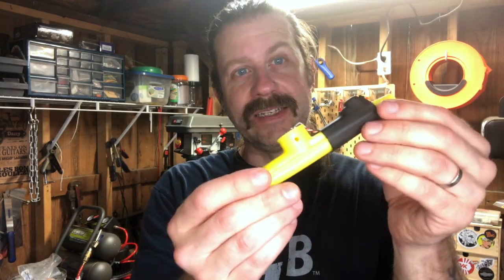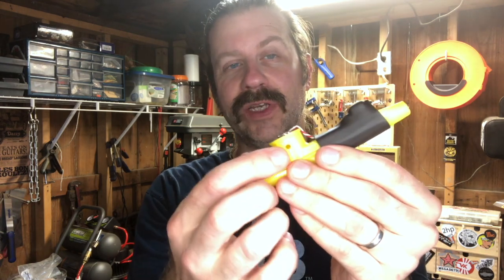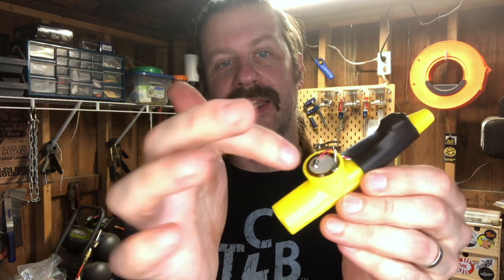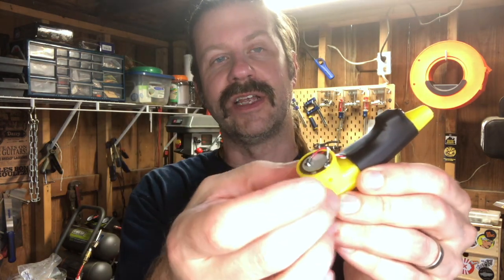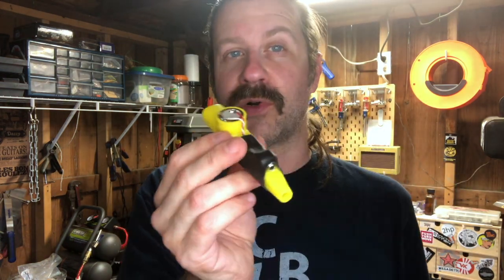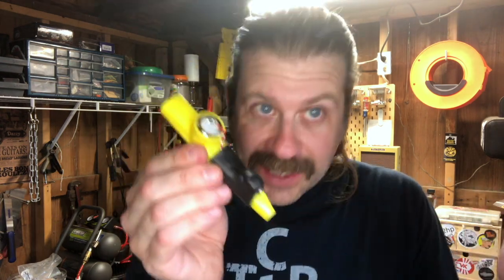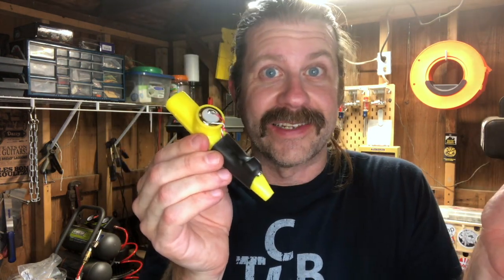So there we have it. Here is our electric kazoo. So you can see it's very simple. This hole that we drilled here is going to let the air out because we're really blocking the air exit with the piezo. So that's gonna allow it so that the membrane can still vibrate. There should be a pretty decent kazoo and it should still work acoustically, though it might be a little bit quieter. So it's not as loud as it was before because we are blocking a lot of the exit there. But let's go plug this thing in and see what it sounds like.